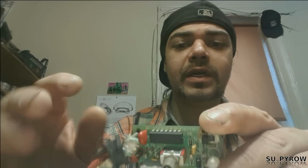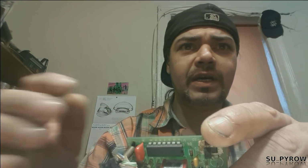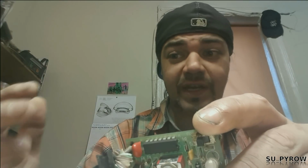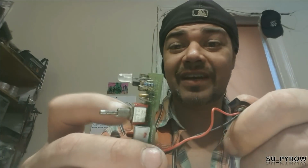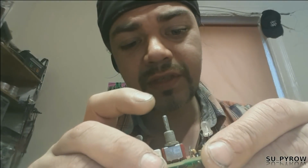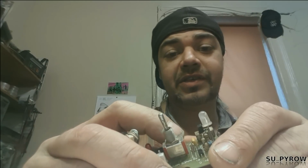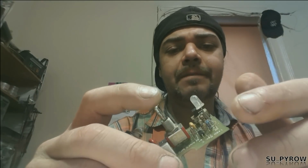Yeah. And that would be a good indication that we're dealing with a CMOS or a logic level chip, which is either 4000 series or 7400 series. This is running off of 9 volts. I don't see a regulator, well, I do see a diode. I don't know what type of diode that is yet either. But let's see, how do we want to go about this?